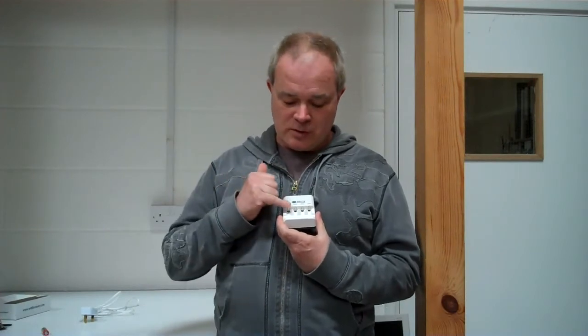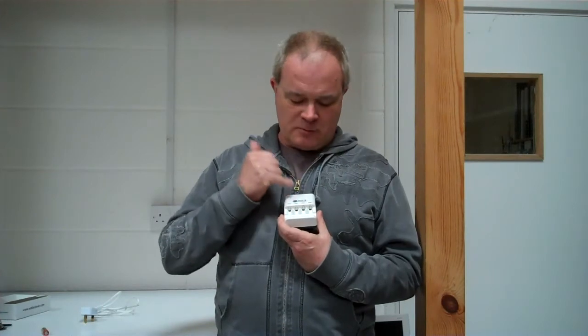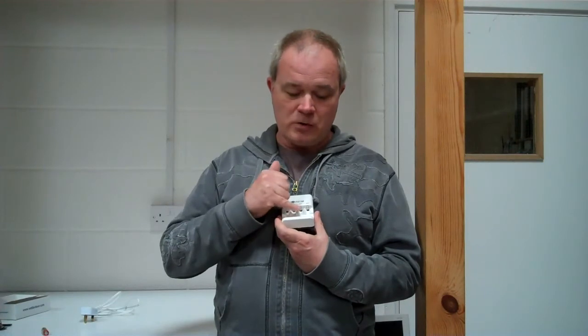It's safe — and that's always a worry — because each one of these charging bays is treated separately by the microprocessor controlling all this. What it does is sense the state of the battery. If the battery is overcharging, it cuts off the power. If the battery gets hot, it cuts off the power. If you put the battery in the wrong way around, it cuts off the power. But it will keep the power going to the other ones if they still need charging.